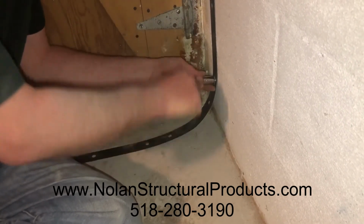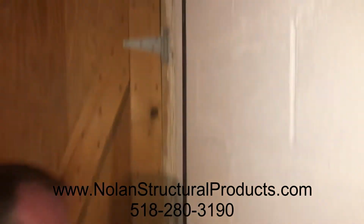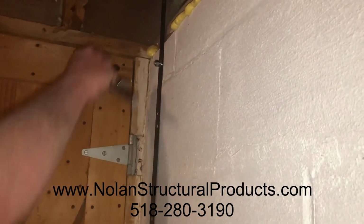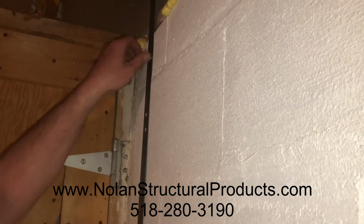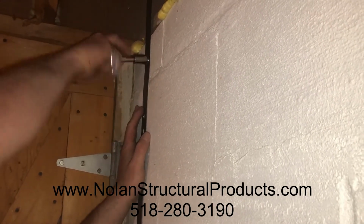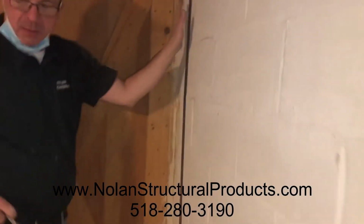Nice. That's good. You don't have to over tighten these because the screws are not in tension. You can go ahead and do the top. I'm just saying that for the video. The screws are not in tension, they're in shear, so just snug them up. You don't need to break your wall or your nut. Great. Now we can see that strap is nice and taut against the wall.